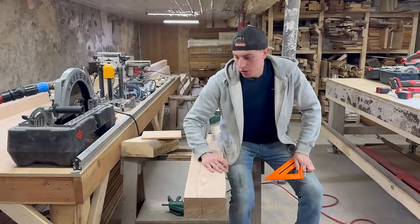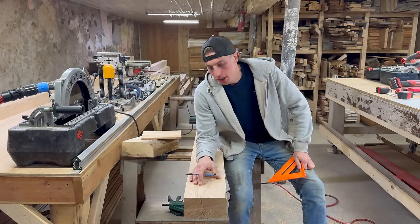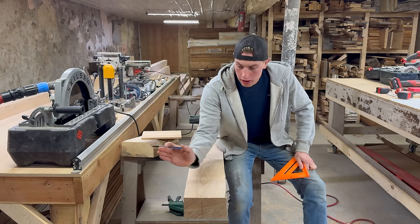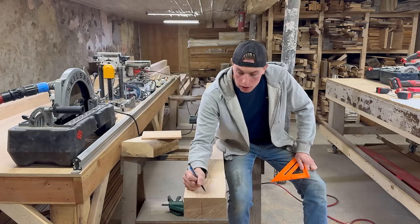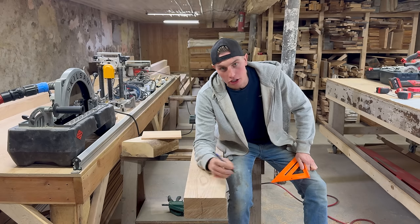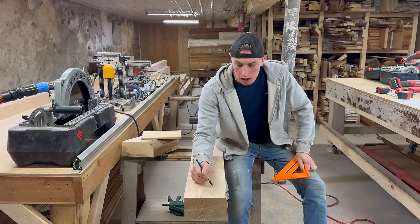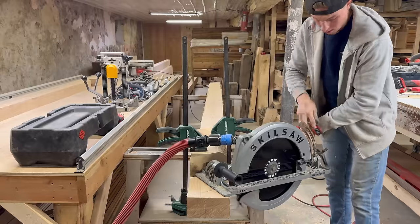So now, we are gonna start working on our roof rafters. What we're gonna do for these is we're gonna cut them on their roof pitch angle, so that'll be 30 degrees, that way it butts up to our octagon beam. And then we'll also put a little, it'll be a shallow tenon and mortise into the octagon beam. It'll be about an inch deep. So we'll cut that in as well. We'll probably use a routing template just to make it easier and get them all perfect.